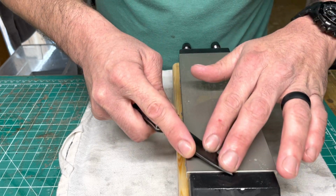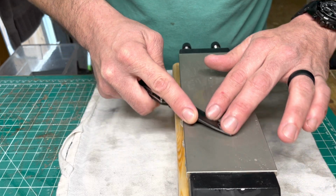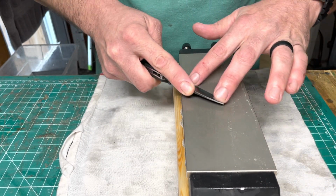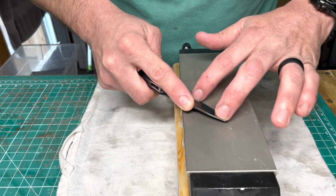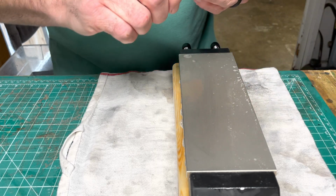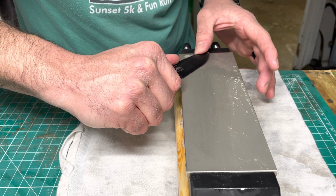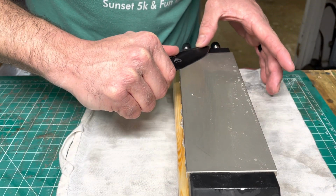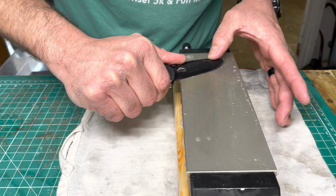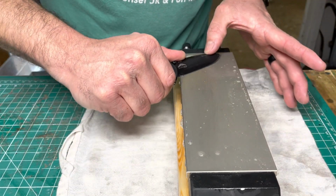It's also easy. Where a lot of guys start to lose it is in the refinement part. You can refine the tooth right out of an edge by working your higher grit stones too long. And that's part of where I like a toothy edge, piece of lint there, comes from, with stopping at like 400 and 600 grit. There's nothing wrong with that. You should sharpen and make edges that work for what you do with them.